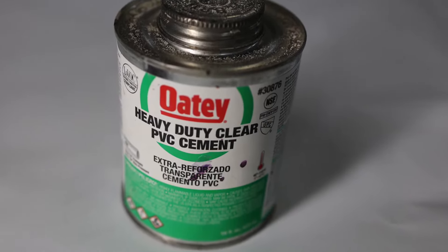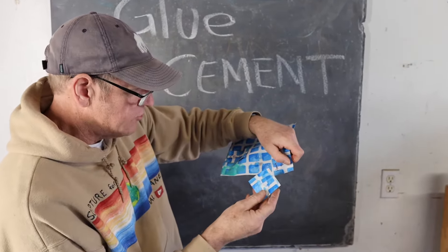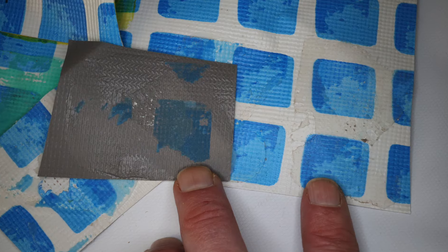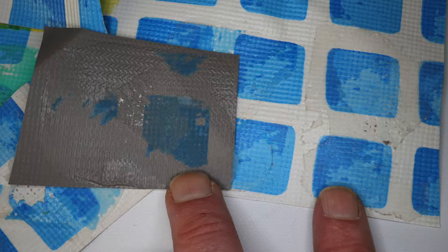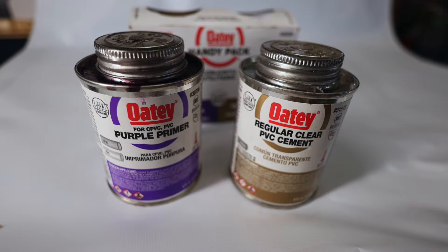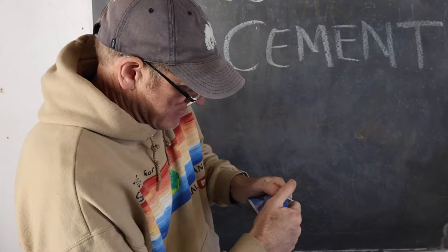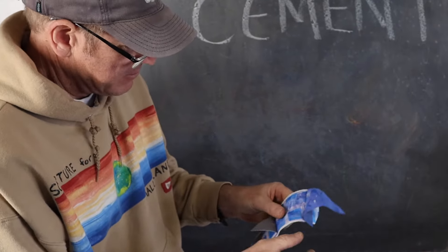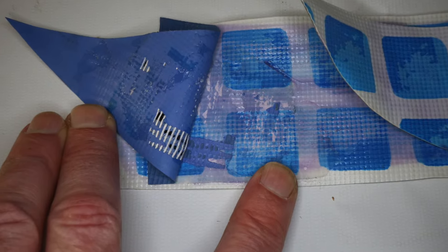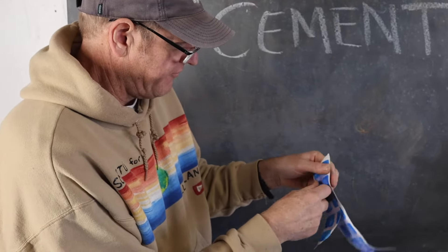Let's take a look at the heavy duty tile-to-tile. This one is pretty good — some material transfer, so this is looking pretty good. On the back side there is a little bit of material transfer, not too bad either. And then here is the regular PVC glue with the purple primer. Quite a bit of material transfer here — yeah, that's just tearing apart the pool material. It's like it shredded it. That's tough. And this one is face to face.